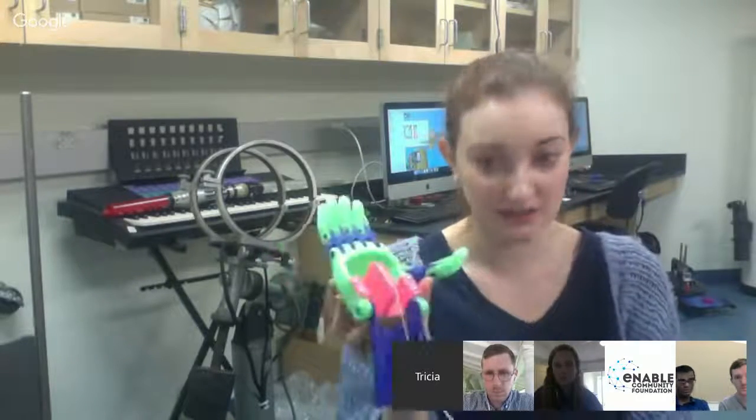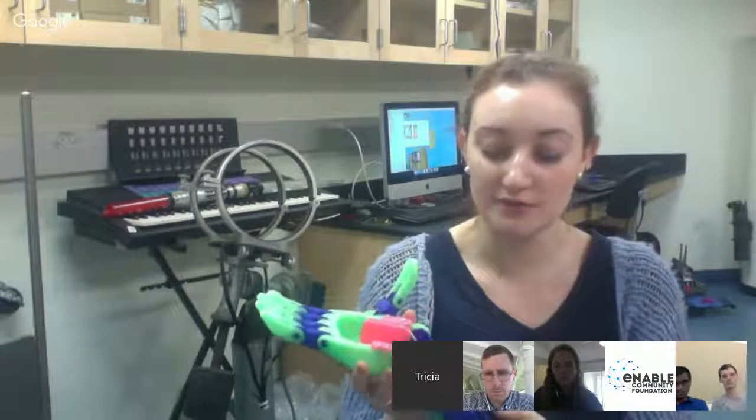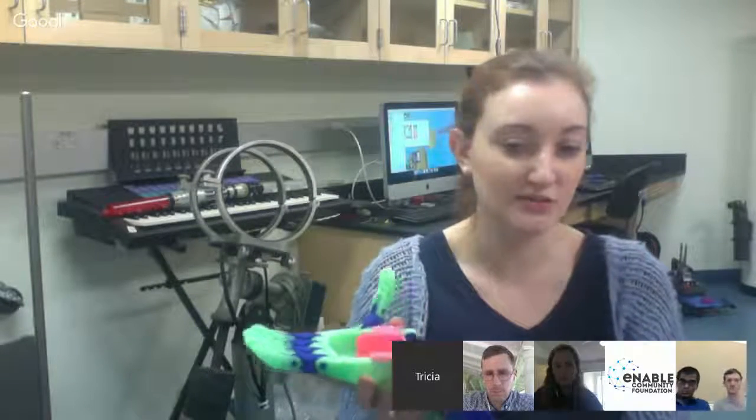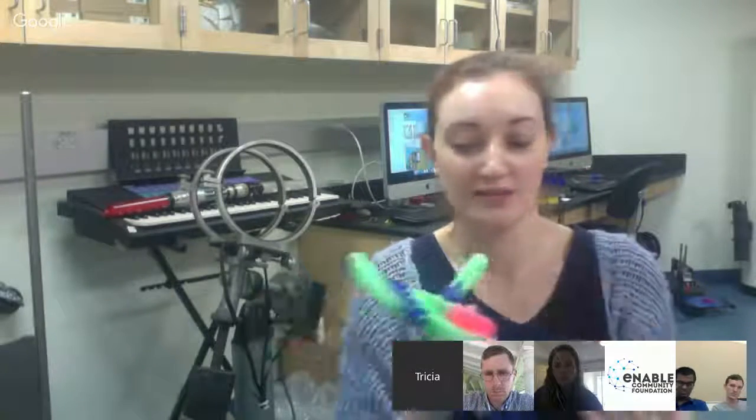But we definitely saw a difference in the Phoenix hand. It was able to grip objects better at lesser forces. So to maintain that grip on that empty tennis ball tube, we found that we only need about 6 or 7 newtons of force, depending on how we placed the tube in the hand. And that seemed vastly different than what we saw in the Raptor Reloaded hand. So we're definitely keeping an eye out for nuances, for things that are going to be significant.